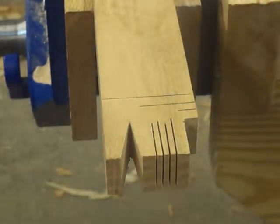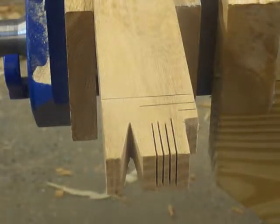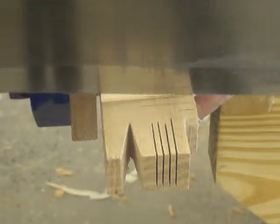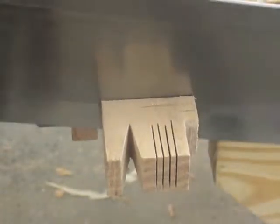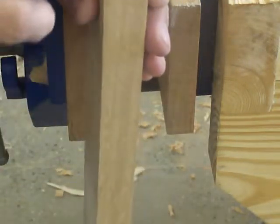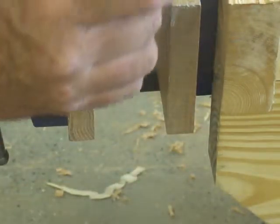Nothing too bad, but I have a knife line here and down the side walls, and we'll do a cross cut because after all I filed this for a ripping pattern. I can squeeze through here. Okay, I filed this for a ripping pattern after all, but let's just see what it does for cross cutting. Right on my knife wall, little effort, very smooth, light motion, very smooth, light motion. So I don't know if you can see this, that's very, very smooth. It hugged my 90s real well.